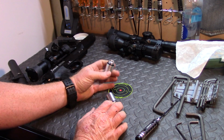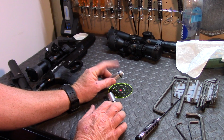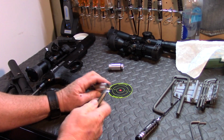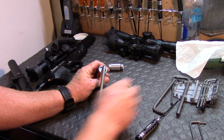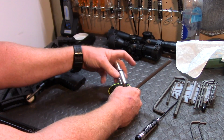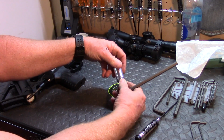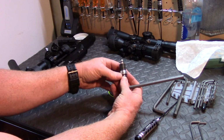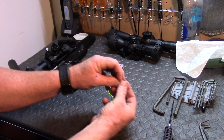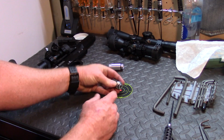This is the plenum, or the void space that holds the regulated air. When you put it back on, there's an O-ring that goes towards the gun. And here's the regulator itself. The regulator on the bottom has, I think this is 8mm, and we can unscrew this and you can get to your washers. If you need to change your O-rings out on your piston inside your regulator, this is how you're going to do it. And your Belleville washers are stacked just like a regular Matador, 2x2. So that just means that the bevels are married together like that. There's your O-ring for your piston and another O-ring at the rear.